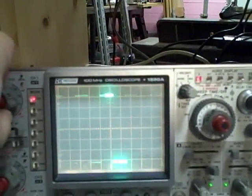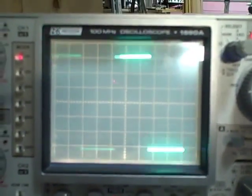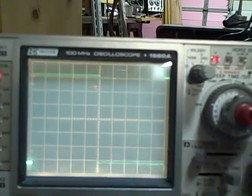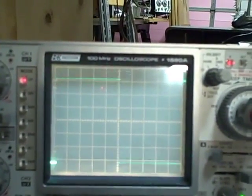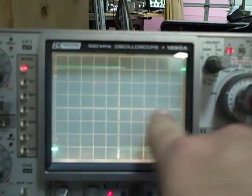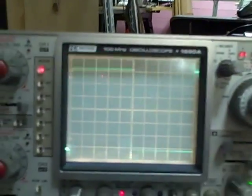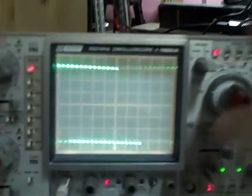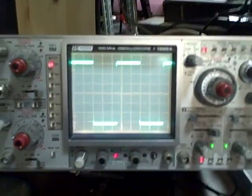I've adjusted my scope so that the square wave is on the screen. I could use this to adjust my timing just as I did with the triangle waves earlier — I look to complete one cycle. There is one cycle across the screen, done in 5 milliseconds per division with ten divisions, that is 50 milliseconds, which corresponds exactly to the frequency called out on this unit. As I step forward in frequency I'll see the number of square waves increasing, and I'd have to change my scale to use them.